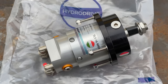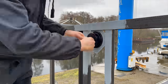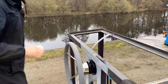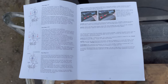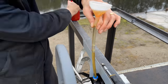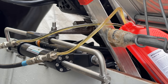Next we can install the steering wheel and the steering pump. I hook up the hydraulic tubes to the steering pump and install the steering wheel. Filling the hydraulic system with fluid is a bitch and a half, especially if you've never done this before, and the over-complicated user manual provided by the manufacturer did not really make things easier. In the end I figured it out through trial and error. The most important principle is that the little plastic tube between the funnel and the pump should never run empty, otherwise you're sucking up air into the system, which you're gonna have to bleed out through the bleeding valves at the steering cylinder, very similar to what you'd do with the brakes on your car.